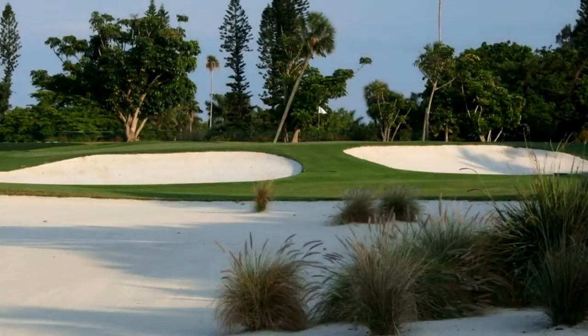You pop down to William Flynn in Miami Beach at Indian Creek, you've got very high sand flash. These bunkers are 6 to 6.5 feet deep. You can tell by the height of the flag stick there. And these do not wash out. And we'll see how they were stabilized a little later. But you've got sand way up at the top, very high, but a very simple shaped bunker with not much edging. Now with Bermuda grass, obviously you're going to have to do hard edging. And that's another issue I want to talk about as well.